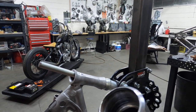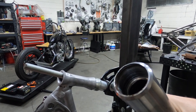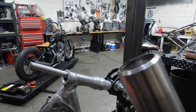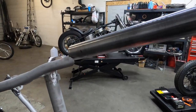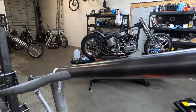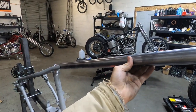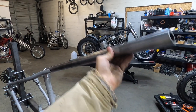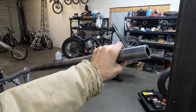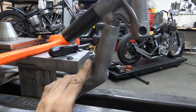Made it off the lathe here. You can see the inside of this tubing - I bored it out. The drill bits I had were super burnt so I had to use a boring bar, but we got that to an inch and a quarter on the inside, because this is 188 wall. I threw a little bevel on it so everything welds good. Now is the time I've got to start thinking about how high up I actually want to go on the neck - stock is somewhere around there, probably bring it up like two and a half to three inches up in the front.